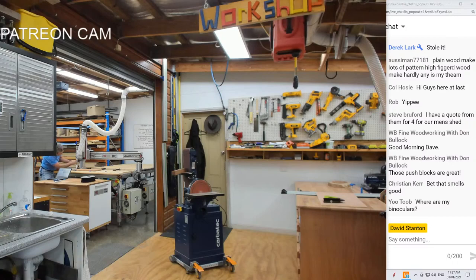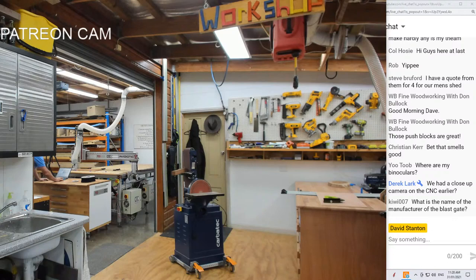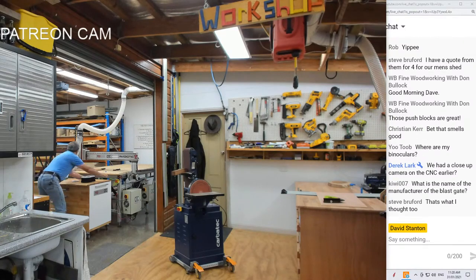How we do that is we connect this to there. So now what I've got, if you can see me in here, is when I bring this over and the cutter actually touches this and the sides, it completes a circuit. So we'll do that first. All right, now we're going to bring this back and back that way and then across and then page down a bit. About there. Now, turning it that way, and let's do the auto Z everything. Making sure I've got the right size cutter in there, and I'm going to put in 6.35 millimeters. And in metric, and we're going to do the corner. Standing here, so if anything happens, I can stop it.